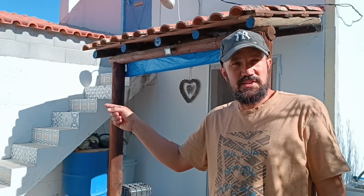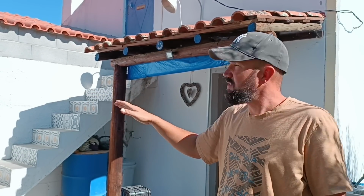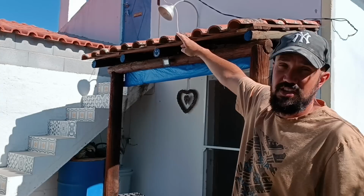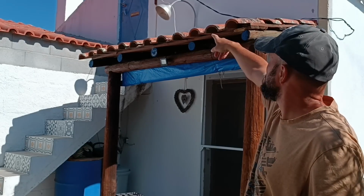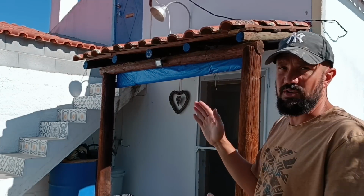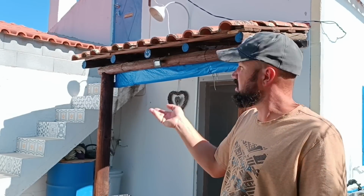So we've poured the second floor in the soon-to-be lounge. While that's setting, we're going to carry on prepping this side to be insulated. So I've got to take down this little roof. The reason we had to wait with that is because we were raising that wall, so we couldn't just do the insulation. So that's done. Now we're going to take this off, take the old spotlight off, just prep everything, and see what we're going to do with the mosquito door. Maybe put it on the inside of the frame, because otherwise the insulation will interfere with that. So we're going to do that, and hopefully if that goes quickly enough, we can insulate this wall quickly, and then take it from there.